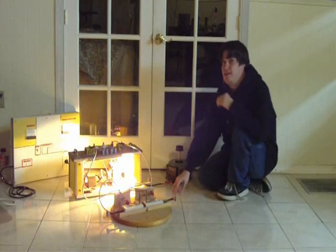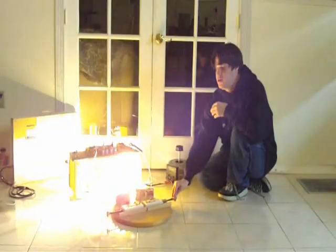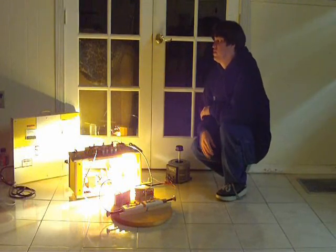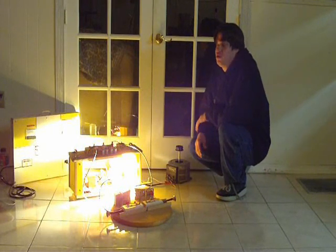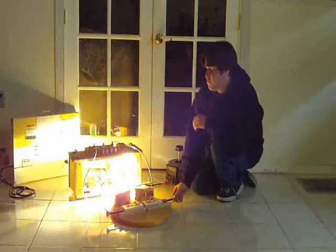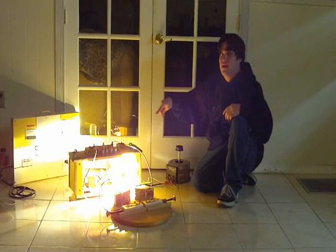You can see what would actually happen if we didn't have the light bulb to limit the current — it would cause a huge current surge. We open the gap and the transformer's not loading; we close the gap and short out the transformer and you can see what happens. The panel in the background is my control panel. The meter on the left is showing the voltage — 120 volts — and the meter on the right shows the amperes, how much current we're drawing; right now it looks like 2.5 amps. So this will supply 4,000 volts, and I can change how much current I supply just by changing the ballast load.